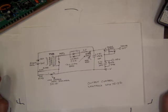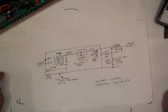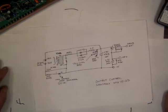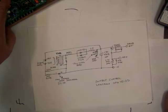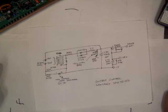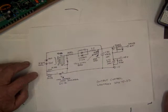Now this is kind of like a destructive test. You can get damage, but generally you can go in there and tap it and you can see, ooh, hey, it starts working. That's a clue. So I did that, and immediately the displays all started working, and then smoke started coming out of the filter capacitor, the big black one on the supply. I shut it down very quick, but the cap did explode. Good thing I was wearing glasses.